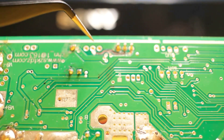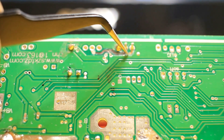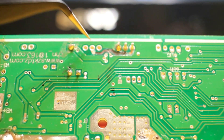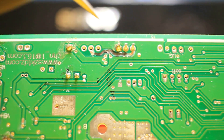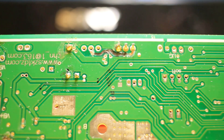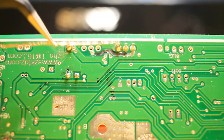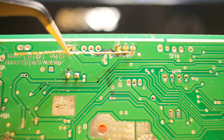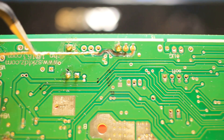As you can see, the trace pulls a lead from here, goes all the way around here, and into this part here — which is a socket for maybe a power transistor or something. I'm not going to put a part in it, but I'm just going to show you how to repair the trace so when I'm ready to put the part in I can do that. I'm going to take a little bare wire, attach it to the remaining trace and solder it in place, then continue across to the other part of the trace, set it in place, and clip off any excess.